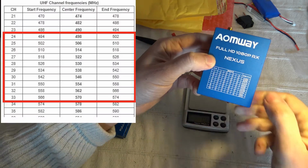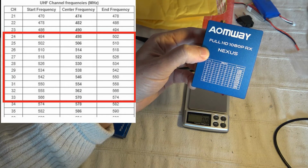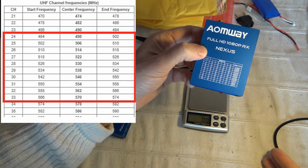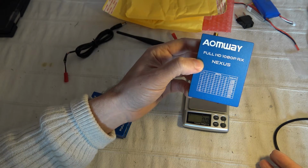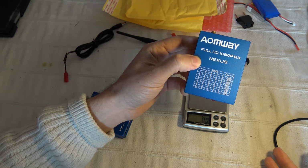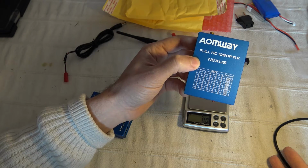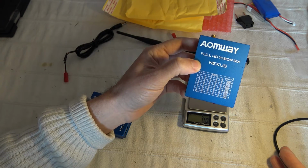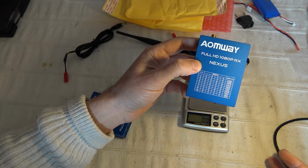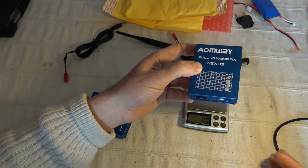Each channel has 8 megahertz of bandwidth, but the central frequency is shifted by only 2 megahertz from an existing TV one. So I don't know if there will be some interferences. You have to know that this system is using QAM modulation plus OFDM techniques, and the main advantage of OFDM is to be able to fight interference coming from adjacent signals. So I hope it will be efficient enough to reject the other TV channel, even when separated by only 2 MHz. I hope the system won't interfere with any existing DVB channels. That will be the main problem, of course.